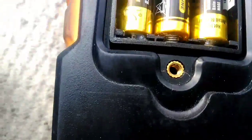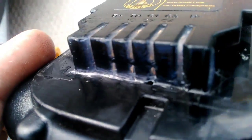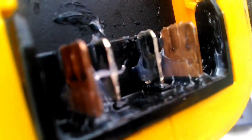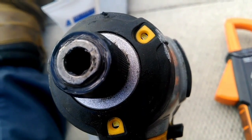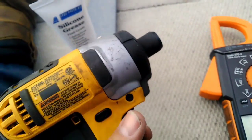There we go — you can see it jammed in there. I've also put it on my battery, on my impact gun, and on the terminals of the impact gun. I'm going to put this all back together. I've even put some into the quick connect fitting on my impact gun. That'll stay nice and lubricated and prevent rust from building up inside there and prolong the tool functionality.